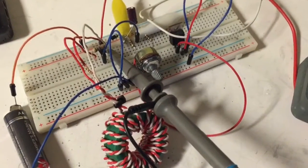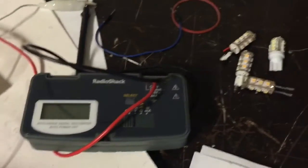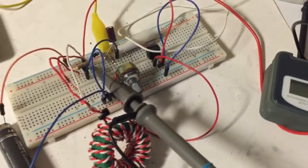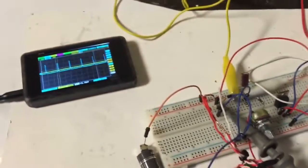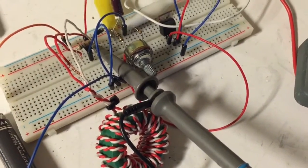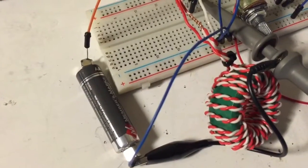So this circuit is modified, and I'm going to be comparing two different circuits. It's modified to lower the voltage based on setting a resistor. You can see that variable resistor on the circuit board there.